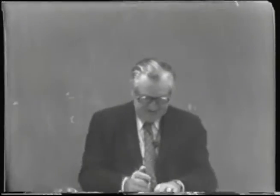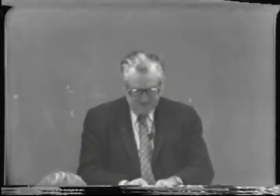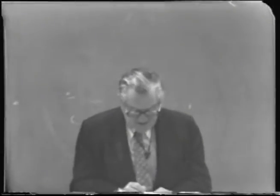Now, time is up here, but I'll just say a couple words. If we're going to make grain spirits, then the distillate from the beer still, instead of going into the doubler, would be diverted, in this case, into the so-called heads column. And you see there, if you take time to trace it out, that whatever distillate there is would be called heads, and that would be a relatively small volume, and the bulk of the spirit would go out the bottom and be labeled unfinished spirits.